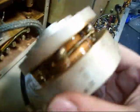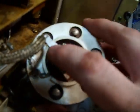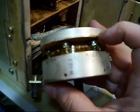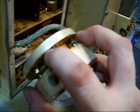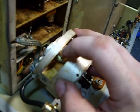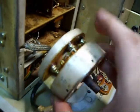Basically this is just a big rotary switch. You turn the shaft and it's got a moving contact and here are your various stops. I don't know if you can see in there, but all it is is a series of resistors — no big deal. This is the signal in from the generator itself. It goes through a series of resistors and finally over here it ends at ground through a resistor, but the output ends over here.